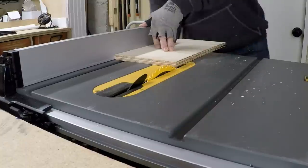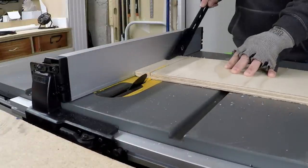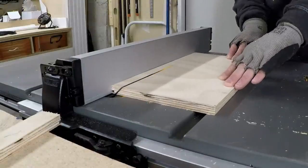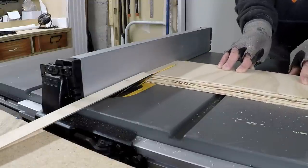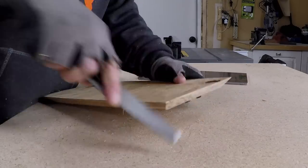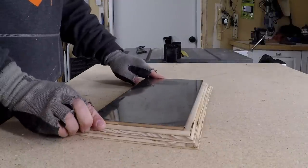Using this piece of plywood I wanted to cut it down and create a 45-degree bevel edge so that I had a little more surface area to work with in terms of sticking it down to the RV. I ultimately wanted to use some Eternabond tape for this, and I wanted to create a nice aerodynamic look with the bevel that gave me that surface area and also allowed water to shed off easier. I also took a file and got rid of any really sharp edges since it's going to be right up against my rubber roof — I didn't want anything poking a hole or making a cut in there.